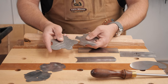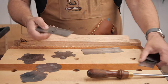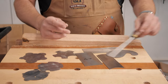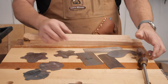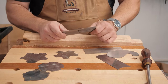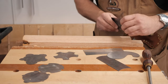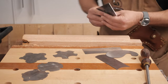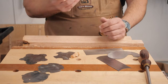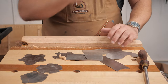You also get into specialty shapes with different size round overs for concave and convex — actually it's called a cove. For eight bucks you can get a three-piece set that works great. The carbide burnisher, which works way better than a hardened steel one, is about 16 to 17 bucks — otherwise you can use an old screwdriver. These are one of those things that just come in handy as long as you keep it on your person or on your bench. Remember not to heat up your piece, and if you're getting dust it needs sharpening — this side is giving me perfect shavings that William Walker would be jealous of. Thanks for watching; head over to the Katz Moses store for an apron, stop blocker, or dovetail jig. Stay safe in the shop and have a wonderful day.